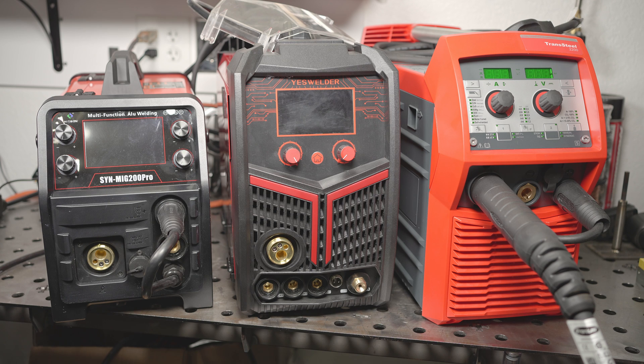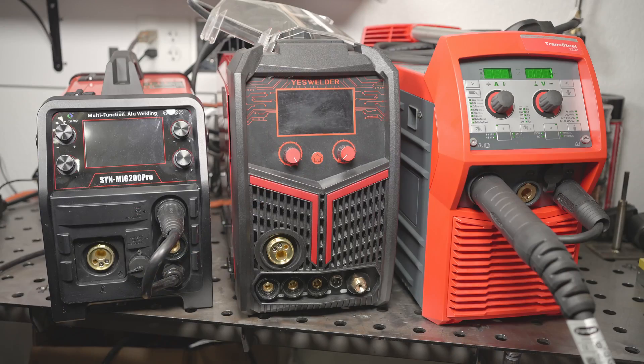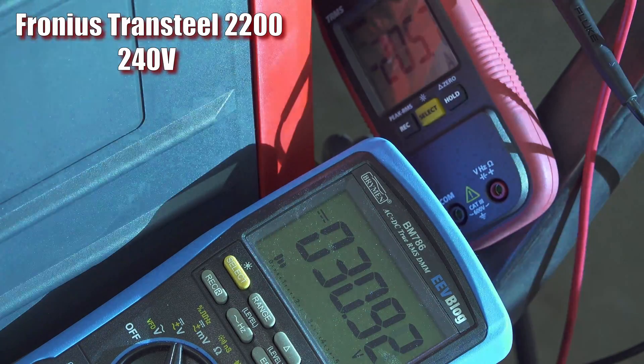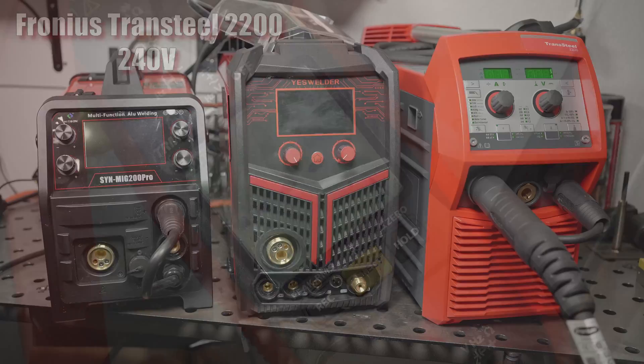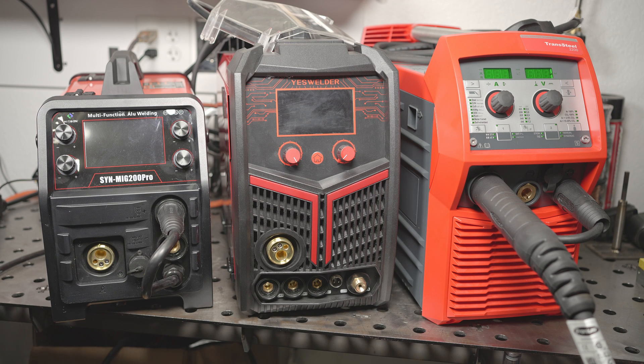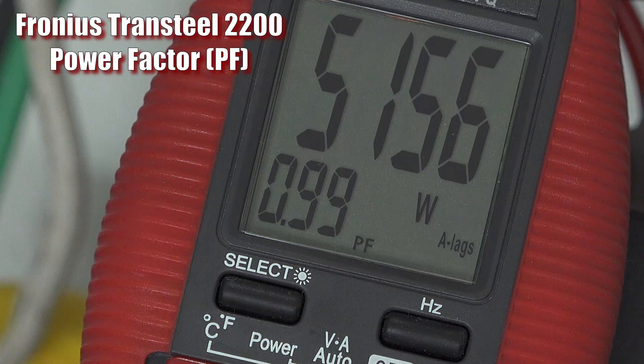On 240 volts, the limit seems to be actually a limit on max amperage rather than on wattage. The rated output is 210 amps, but it will go above that — 225 amps or so seems to be the limit. So I can run around 25 volts and it will smoothly crank out 220 amps, no problem. This provides an output wattage well over 5,000 watts. Since it seems to be an amperage limit rather than a wattage limit, I can crank the voltage up — here I was running 30 volts at over 200 amps, providing over 6,000 watts, and was starting to spray even with 75/25 gas. Despite the output wattage being much higher, the input current was still less than the other two, largely down to the power factor correction. Power factor on the Fronius is right at 0.99 — for reference, 1 is unity, so you can't get any better than a power factor of 1.